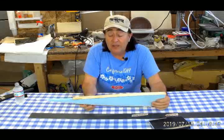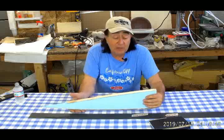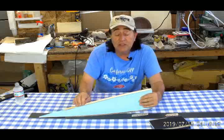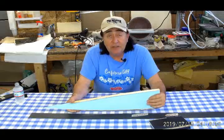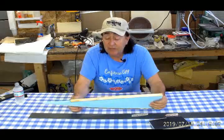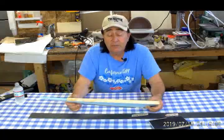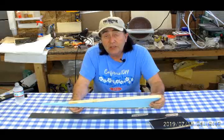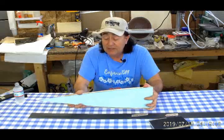For the elevon area, the skin of the wing is going to be fabric, and fabric of course can't carry any appreciable load, so the fabric is bonded to some nice wood cap strips. But there's an elevon there, and the elevon can generate very significant loads on the ribs up and down as we deflect it. The ribs have to be considerably stronger than just for straight-ahead flying aerodynamic forces. If you're doing a lot of maneuvering and go full elevon, the loads can get fairly significant, so the ribs have to have really good bending stiffness.